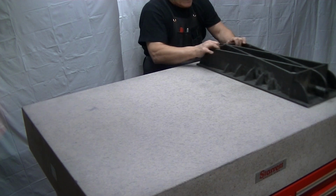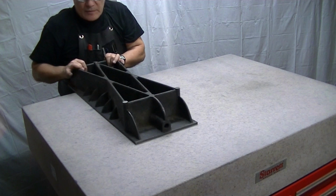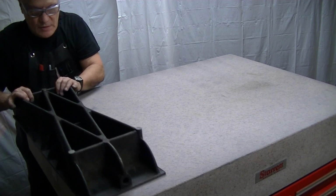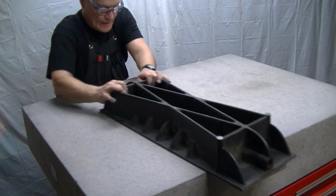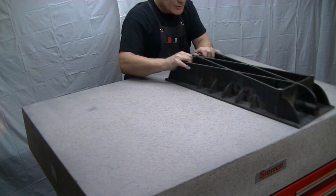Now right this end right here is right where we need a lot of material removal. And just like in scraping, there's nothing saying I have to take this whole end down, but I have a hunch that there's some holes in this end also, so rather than risk doing a stepping where I would just progressively work more and more on this end so that I didn't have to remove as much granite because there was a hole that's on one end.